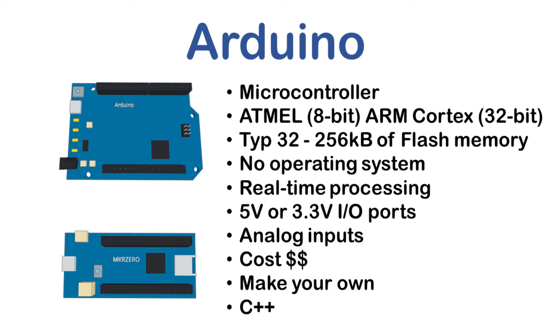The programming language commonly used with the Arduino is based around C++, which is well worth learning. There are also some versions of Python that can run on some Arduino or Arduino-like boards. There's no screen or keyboard needed, which can be an advantage or disadvantage depending on your needs. Some models can save to microSD cards, but most don't have any permanent storage. The Arduino is best as a device to control hardware directly with minimal user intervention, or where human interaction is through a simple homemade interface — in that environment they excel and are extremely reliable.